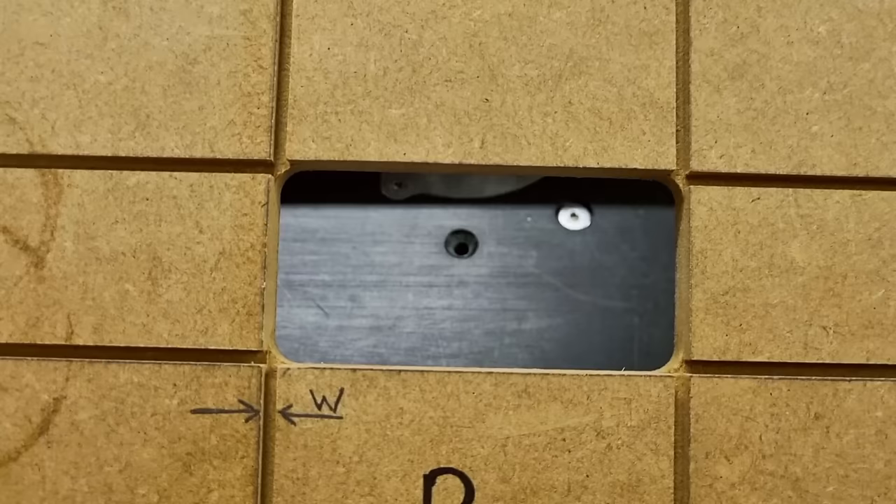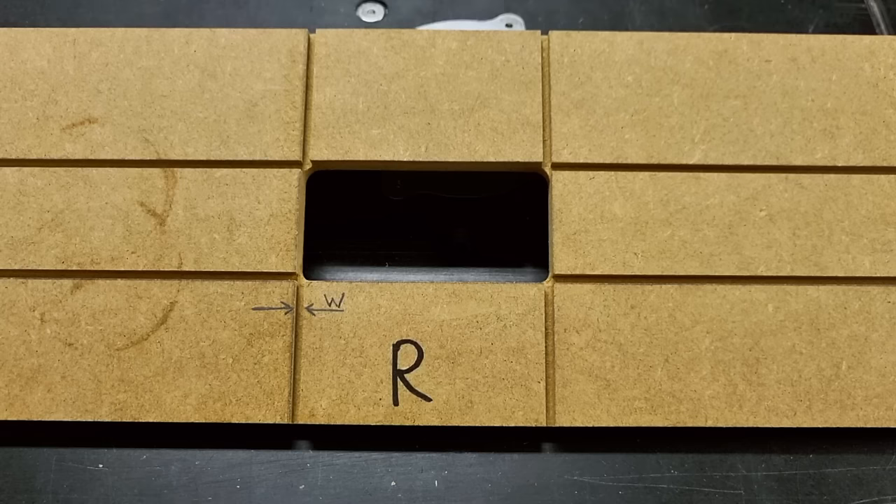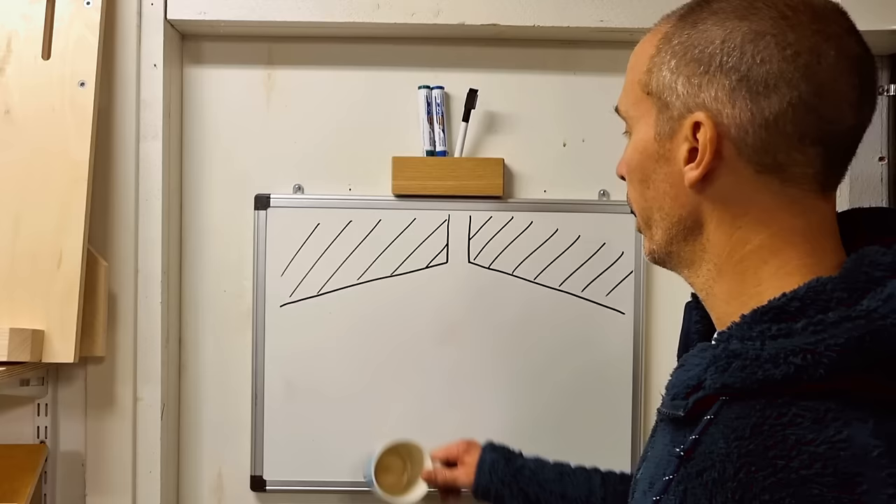You might get a small step inside between the saw surface and the routed surface, but that doesn't matter. In the corners these are perfectly rounded and match the router bit diameter, so the grooves didn't cause any step or corner problems. As long as the router bit radius is bigger than the width of the saw groove — which it always is — the grooves won't cause corner problems. This rule applies to square corners; for very low angles at some point the router bit may bump into the groove and create a small step.